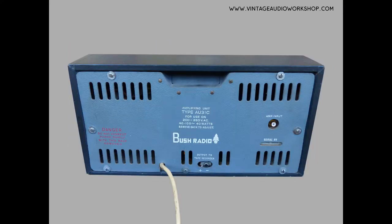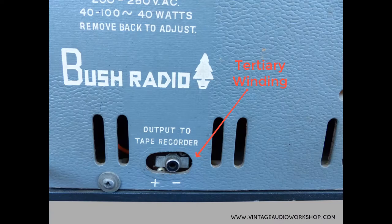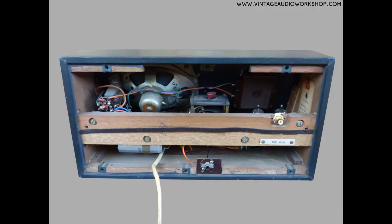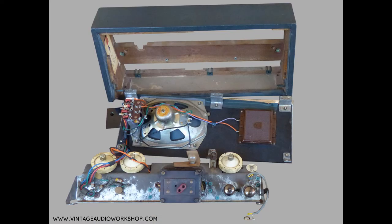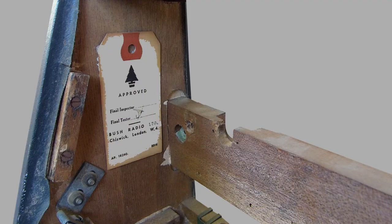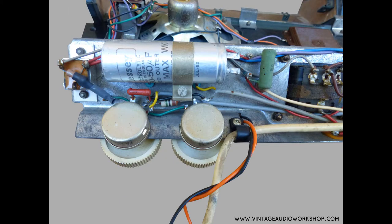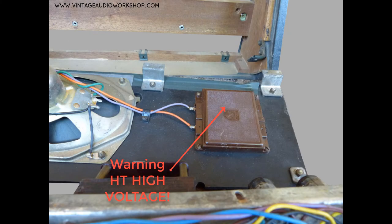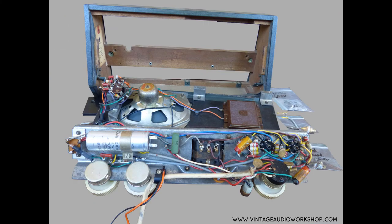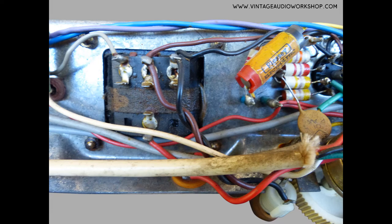You've got the AU31C model here, which is only the extension box with the amplifier and speaker for getting your stereo. With a tertiary winding, you get a line output — it's post EQ and feedback, and you get the pentode side of the valve working as well as an output transformer winding. You've got to watch out for the electrostatic tweeter: there's HT on there, so don't go cutting those wires until you've checked, switched them off, and so on.